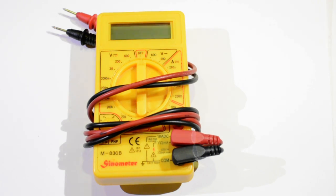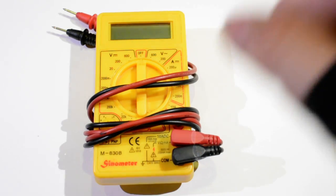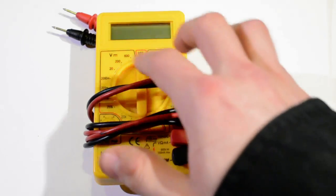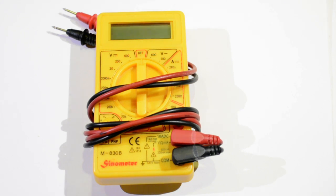So I decided to tackle this problem head-on, and I added into this an ATtiny85, which taps into one of the pins of the epoxy blob on the circuit board, and reads the reading, turns it into a frequency that it sends to a piezo buzzer.